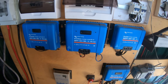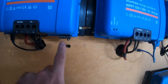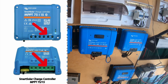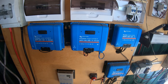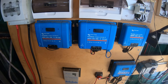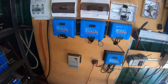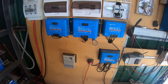There are some caveats with the 100/20: it has got load outputs on it. What you've got to watch out for is that the load output is a load output when it's at 12 or 24 volts, but as soon as you go to 48 volts — and I believe this to be the case, though I've never validated it — the load output is locked down to two amps only, so it's effectively a relay at that point. If I was to put these in a scale of most cost-effective, it's easily the 100/20, but it doesn't work at scale.